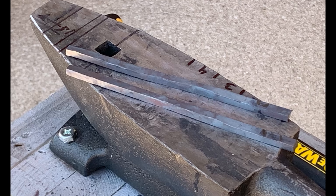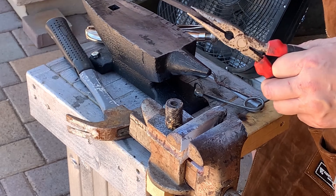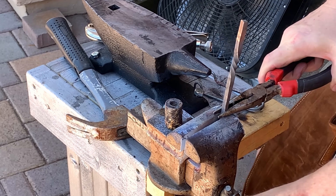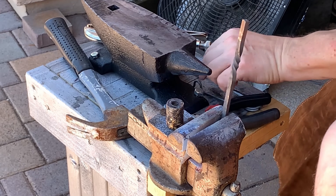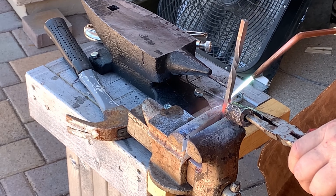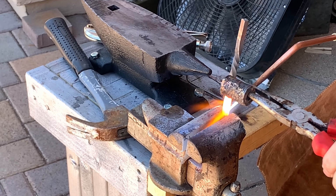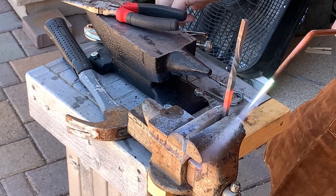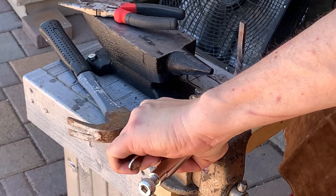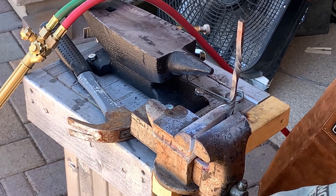Here you can see a couple of sticks after they were drawn out and hammer straightened. The twist is the next step — that's the most fun part. It's attractive and it's functional, because it helps the stick stay in place whether you have thin hair or very thick hair. There are a number of ways to do this, but I found that the oxyacetylene torch was the easiest. It took about 10 tries on various pieces of metal until I found a twist that worked every time. I usually use the collar you see in the video, but once in a while it got stuck — it'll either be a bend or something in the steel that'll swell up and prevent it from going. Whether I use the collar or not, it allows me to be very precise with the heat each time, so I create a very consistent twist.